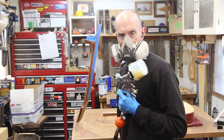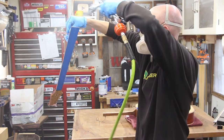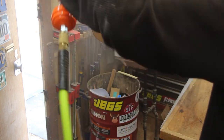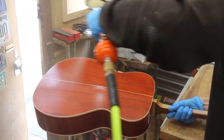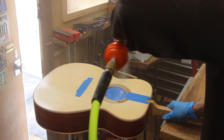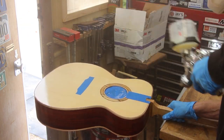It's go time. When I'm applying this finish, my main goal is to get enough material on there that I can level sand and polish without having extra material. I want the finish to be as thin as possible to avoid anything affecting the sound and the ability for the body to vibrate. At the end of spraying, I have about four coats of clear on there. Hopefully that's not too much, and yet still enough.